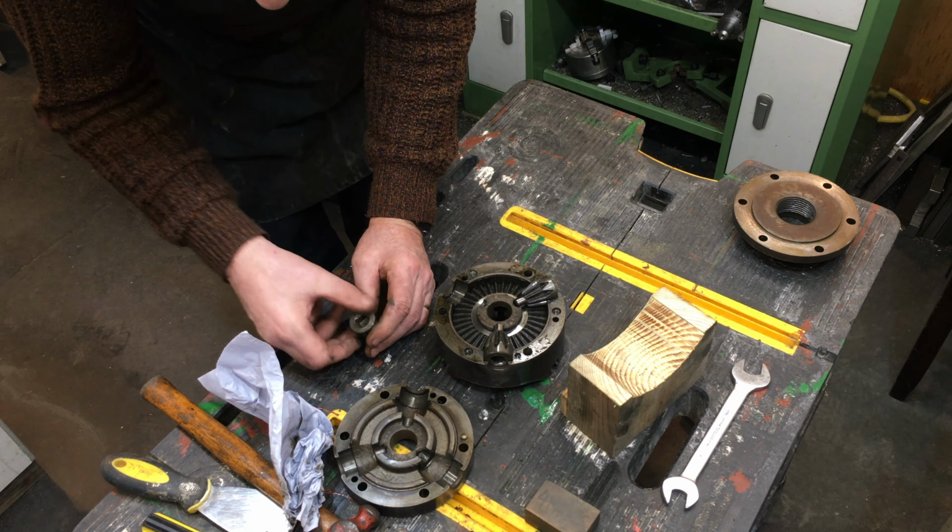These two V-blocks allowed me to lightly skim 3 thou off this top face. They also allowed me to rotate the back plate 6 times through 60 degrees to do many spark out passes. Despite taking off 3 thou, a witness mark still remained. I daren't take too much off the overall length for fear of having the spindle nose thread crashing into the back of the chuck before the back plate has properly seated against the spindle nose face that I machined earlier. I compared the parallelism this way up because if there were any issues, it would amplify it.